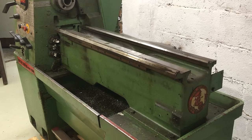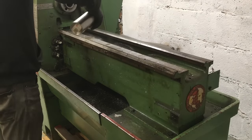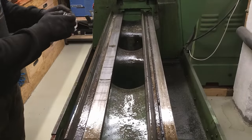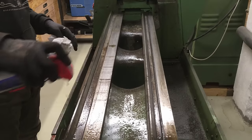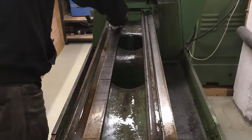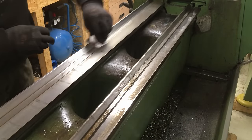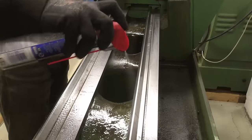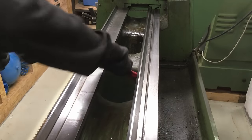And there we have it — a naked lathe. Since the disassembly went way faster than expected, let's at least get the base of the machine cleaned up so we can see what we're working with in terms of condition. For cleaning I always follow the same plan of attack: spray everything down so it can soak for a while, then it's time for some elbow grease. Precision surfaces only get touched with towels or rags — never with Scotch-Brite or anything that could even remotely be abrasive. That would be a nice way to destroy your machine. Of course this takes ages with only soft materials, but it is worth it. On painted surfaces I use Scotch-Brite, or if the dirt is really hard on there I like to scrub it with a brass wire brush.